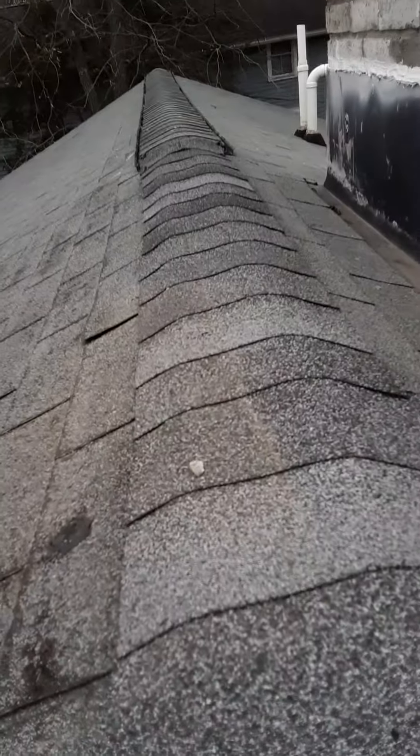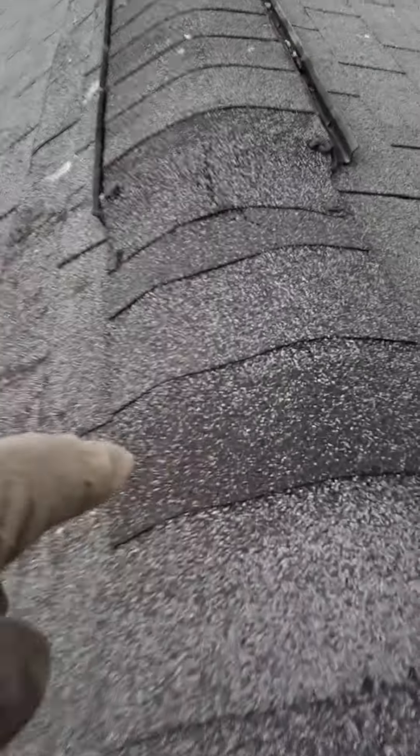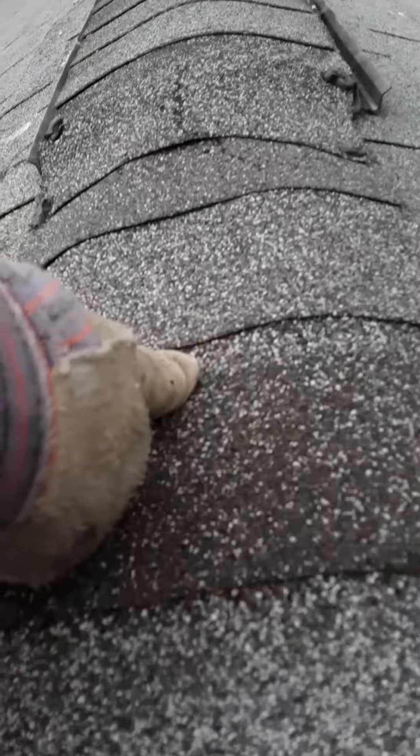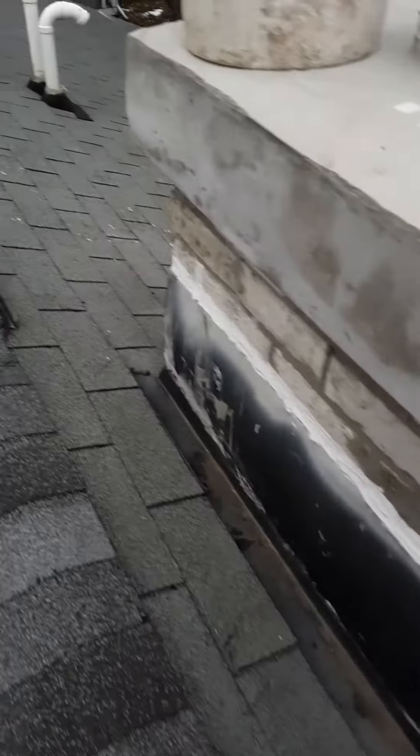It's not adequate to have these flat spots where water can rest in little pockets up here. It doesn't look like it's resting but it is — and that's where your leak is too. In a heavy rain, the water gets through there and goes right through, let alone the chimney that was all falling apart.